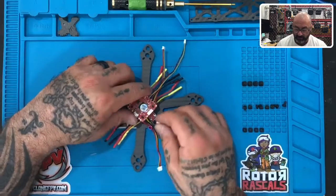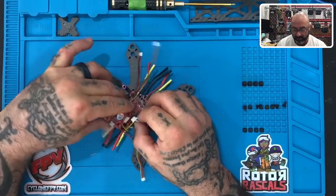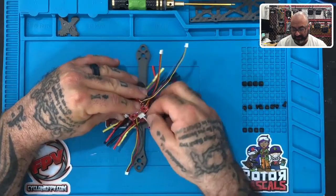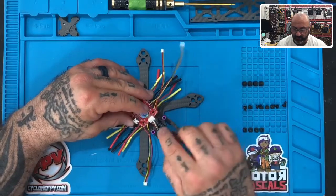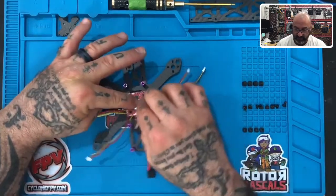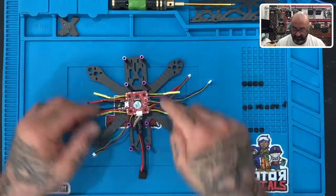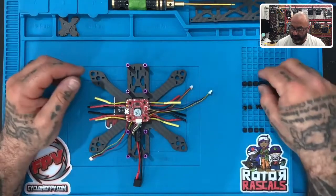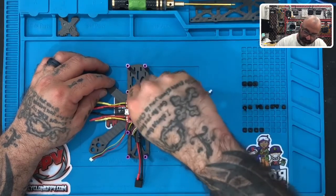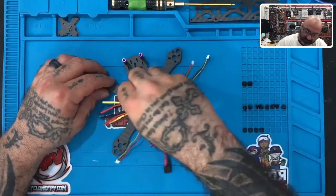Place the flight controller on just like that and get ready to plug your wire harness in. Don't worry about the colors right now — just know the red goes all the way to the left and the bluish color goes all the way to the right. It will plug in easily. That's what it should look like when this part is completed. Everything is faced properly, and now take your last set of standoffs and screw those in to tighten it down so the flight controller cannot move.